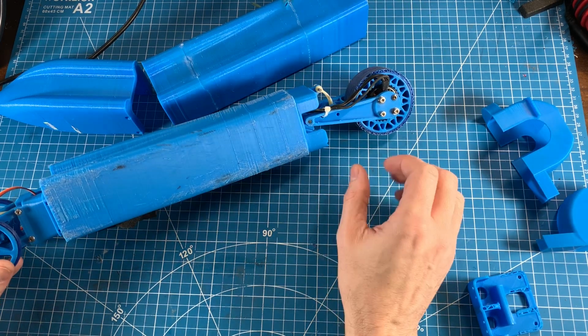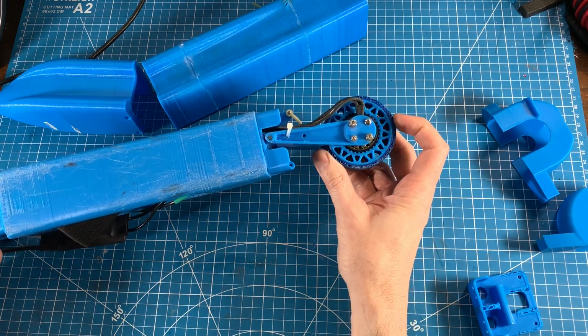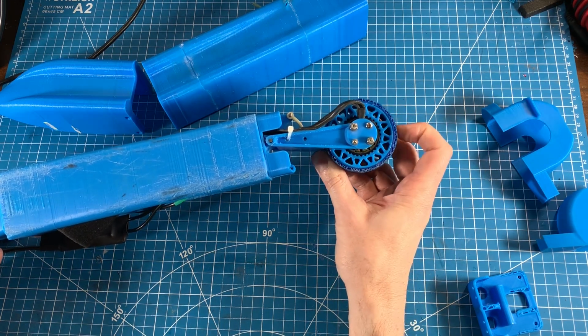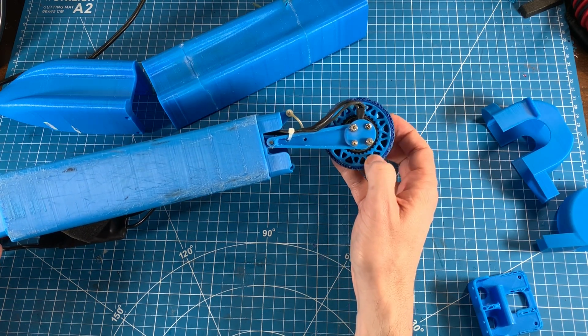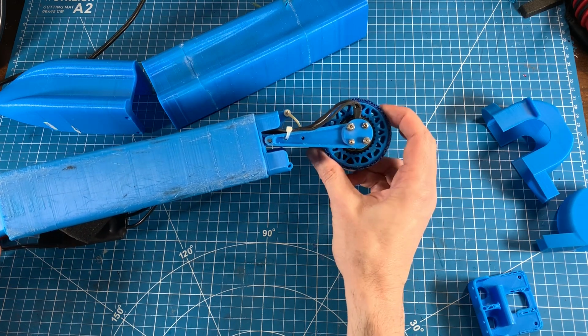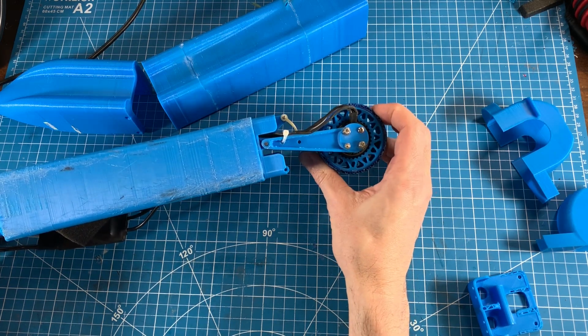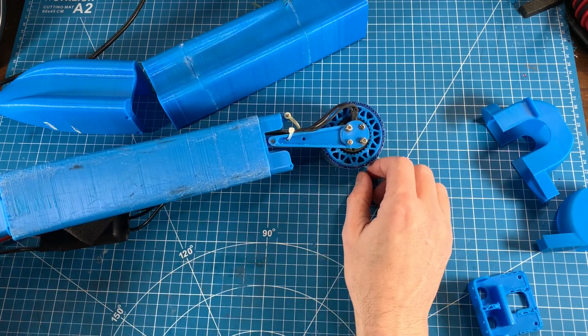And this is, I believe, due to a few reasons. One, this tire is very low profile, and it's not giving very much spring. And this plastic, the PLA here, is obviously way over engineered and too heavy. So it has no flexibility whatsoever. So what was happening is essentially the tire was skipping across the surface.